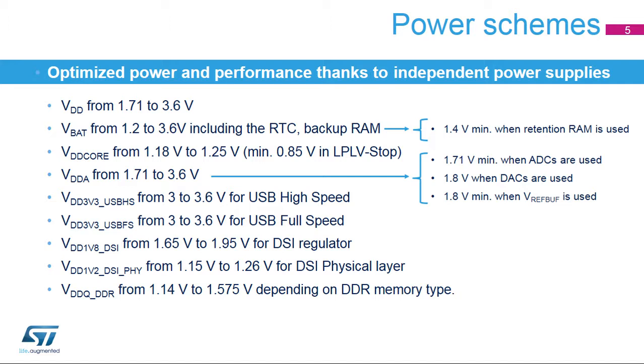The CPU entering low power mode is controlled by the WFI and WFE instructions, and the deep sleep bit allows mode selection between C-sleep and C-stop/C-standby modes. When the CPU enters C-stop or C-standby mode, the system operating mode depends on the other CPU. C-sleep mode is exited with an NVIC interrupt or RxEV event. The way C-stop mode is exited depends on the system mode: when the system is in run or stop mode, C-stop is exited with an NVIC interrupt or RxEV event. When the system is in standby mode, C-stop is exited with a reset. The MPU exits from C-standby mode with a reset.